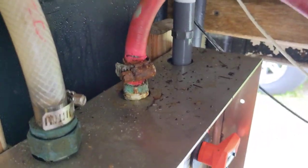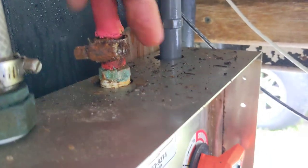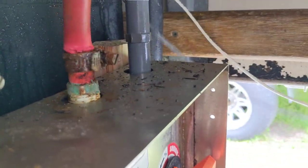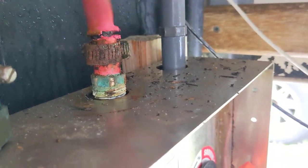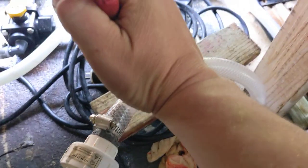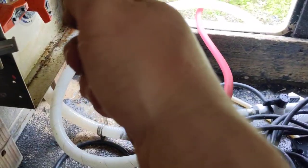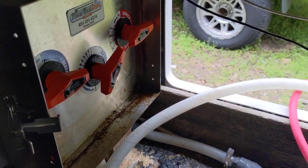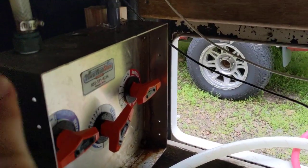So, a couple things. I've seen guys talk about before where their bleach tank, or their soap tank, or whatever — something's getting bleach into it. You can see that brass hose barb is all kinds of corroded. Now, that shouldn't happen from just soap. What it means is that the check valve inside here was likely getting stuck in the open position, and bleach was coming back through and up into the tank.